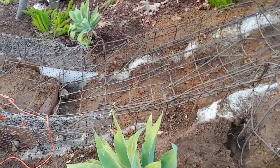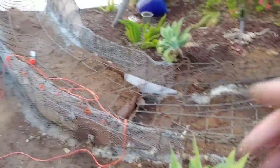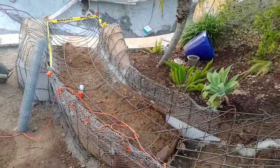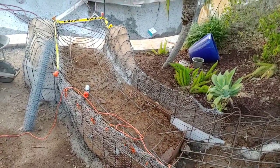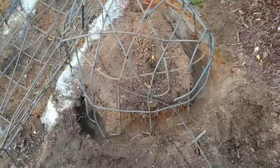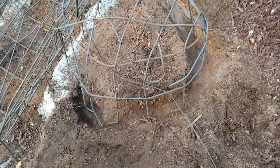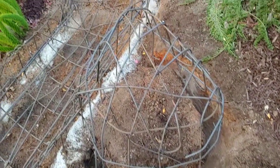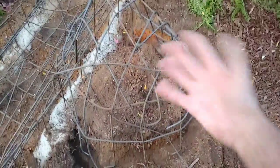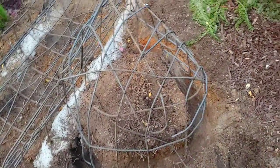I like having more rebar rather than not enough — it's a lot of rebar. I'm going to put some more trough-length rebar sticks down there to fill in those gaps. Here's the rock — I just threw it together, dug out the footing, pre-bent the rebar, mixed up the concrete. That concrete is going to go in this little trench here, and tomorrow we can do the burlaping and this will be ready for shotcrete day.